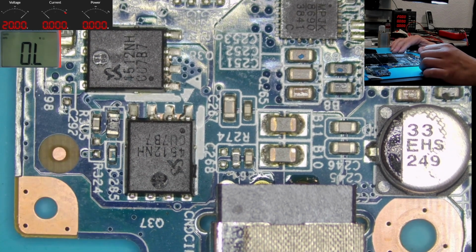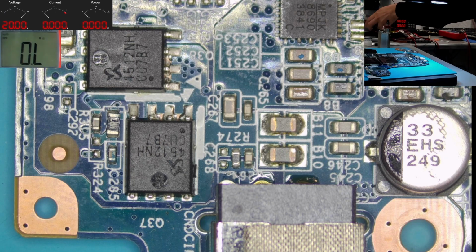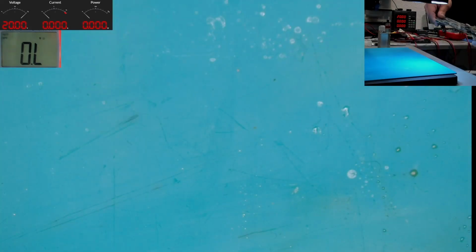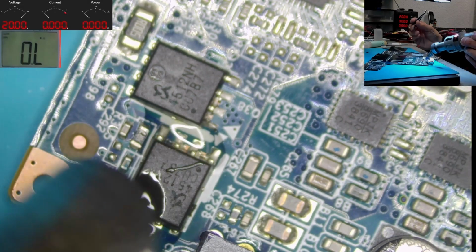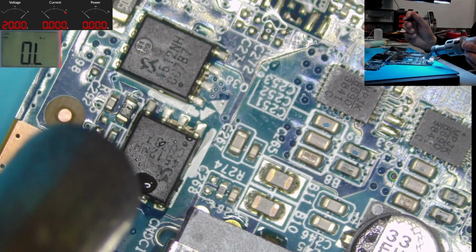Let's have a look for a proper replacement. Is it N channel? I think so, no? Let's assume from the charging controller. Where is it? Oh, don't tell me it is this MPS IC. Please not here. BQ24781, which works with N channel. Okay, so we need a proper N channel replacement. So I find one on another gaming board, hopefully suitable.